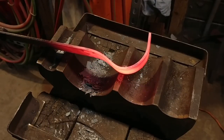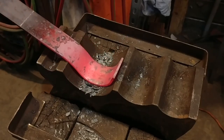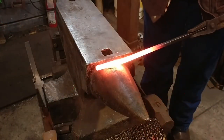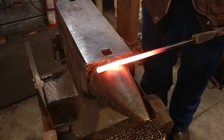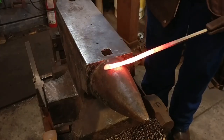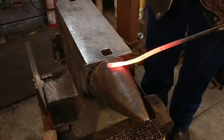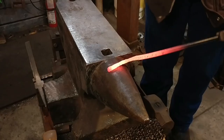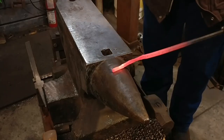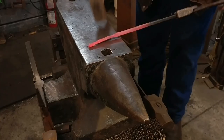The trick to actually making a branding iron is you need enough mass to the metal that it does not bend readily. If you have small parts or not enough mass, you have to back them up with more mass. Of course, backing them up with more mass means it takes longer to heat up because that mass draws away the heat from the branding iron. So you need to split the difference. I went with eighth-inch thick material to create a really small, clean edge when it brands, but two inches wide or deep to allow enough structural support so I'm not getting bending and warping. Hopefully that'll make sense when you're designing your own branding irons.